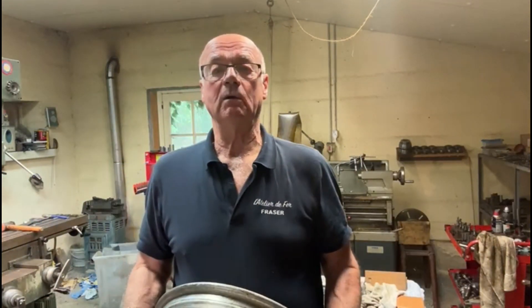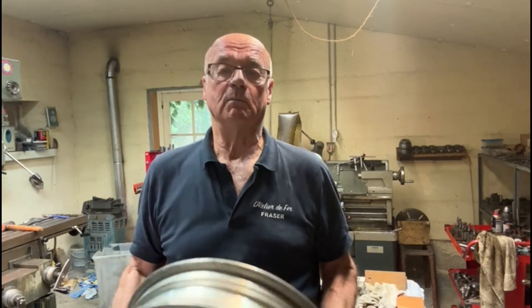Hope you enjoyed that video. I had to change the material halfway through — I changed from a steel bush to an aluminium bush, not for any particular reason apart from the fact that I went slightly oversize on the bore, so I had to start again and changed my mind and went to aluminium. Job done. If you haven't already done so, please subscribe to my channel and look out for me in the next video. Goodbye!